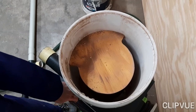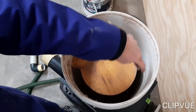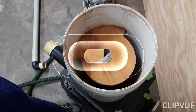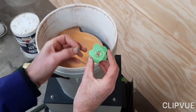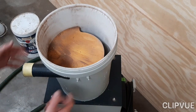At the bottom of the paint tin I just cut out the bottom and added a few screws on the side that fix it to the top of the box. The knobs are basically just 5-star knobs with a threaded insert on the inside and a little washer that threads onto the threaded boss in the cabinet at the bottom.